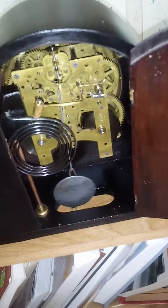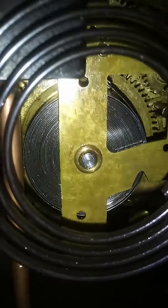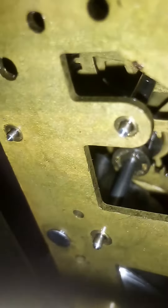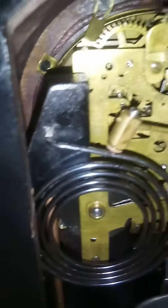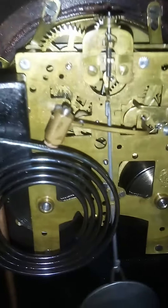The most interesting thing about the movement to me is that instead of the mainspring being hooked around the little post at the bottom, it's hooked on an extra stud — that little silver stud there, which is actually steel. They did that so the mainspring will expand outwards instead of inwards and interfere with things in the middle. That's the only reason I can figure.